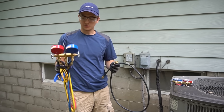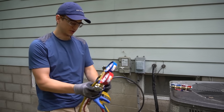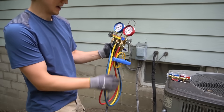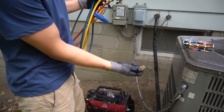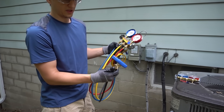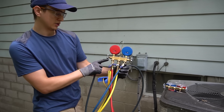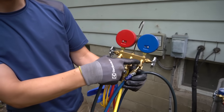When I was putting on my high side hose and taking it off, did you see how a little bit of freon escaped? That's where the low loss fittings come in handy. I usually do have a low loss fitting on my red side, but mine started to leak through — there's a little repair kit for that, I just haven't gotten around to fixing it. That's why I'm using a standard ball valve. My normal setup is a low loss fitting on the high side and two ball valves on the low side and the auxiliary.